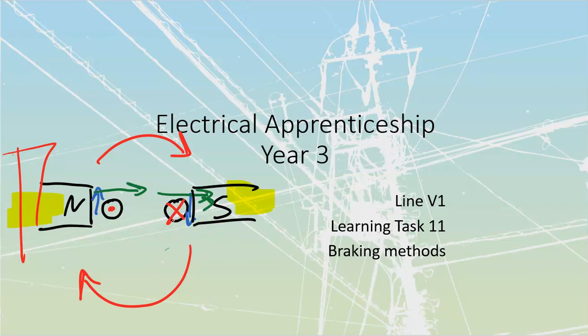What does that do? Well, it's going to create its own circulating current around each one of these. We'll just draw that circulating current, once again using your left-hand rule. Left-hand rule for conductors means that this one over here is going to have lines that go around like that. Left-hand rule on this one means that its lines are going to go around like this. Which means that now when I interface them with these lines over here, I'm bending that line up and down like that. Then this one heads across, gets caught, bent around like that. And so what I see is that the new thrust is now going opposite to what my old thrust was.